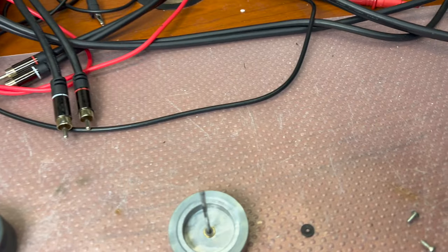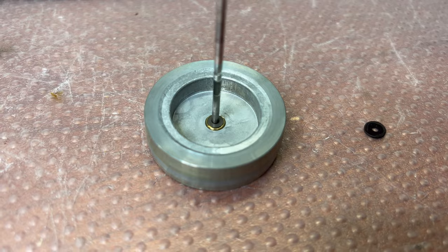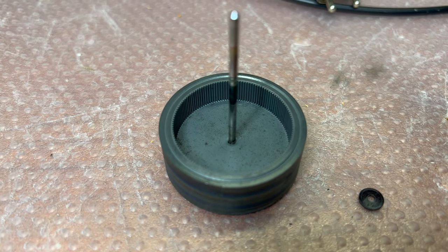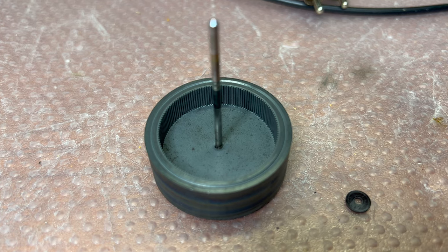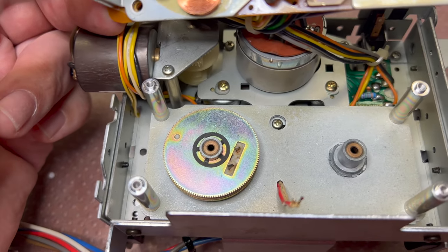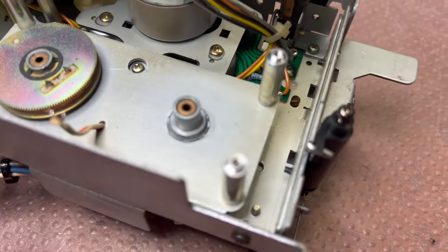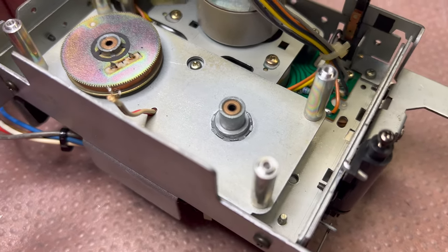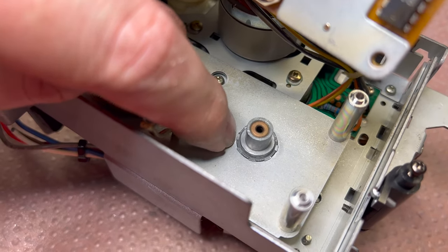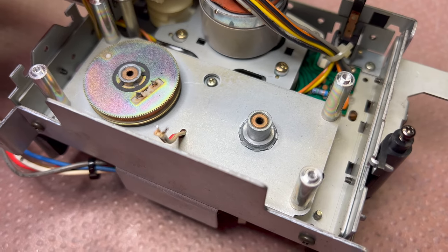Here I've just removed the capstan. On the supply side capstan we have a low friction spacer; on the take-up side we don't. You can see how this capstan is formed with all those teeth, and we have a pretty similar FG coil as on the Nakamichi Dragon — same principles. The stands with bearings are a little bit different; these stands hold the base. I believe replacing these bearings is not possible.